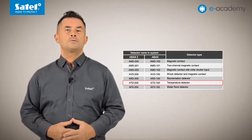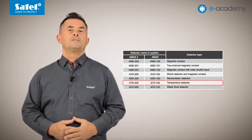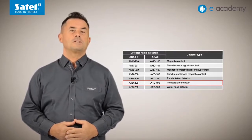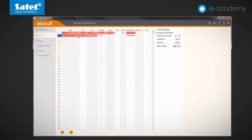The sixth on the list is the temperature detector, designated as ATD200. It reports an alarm when it registers exceeding defined temperature thresholds. The device can occupy one or two positions on the controller. Exceeding the temperature limit will be signalled on the indicator output if the temperature falls below the value programmed for the lower threshold, L, or rises above the value programmed for the upper threshold, H.